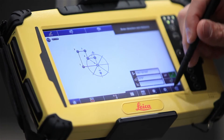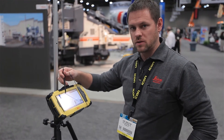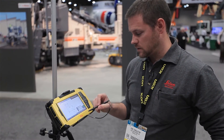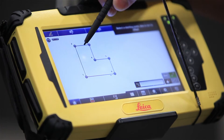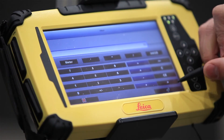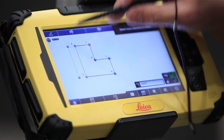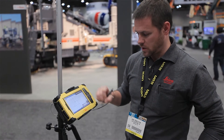So from this point I've got my foundation in, and I know in the field the surveyor has given me two points to start from. Those two points are an offset from this building line to the left at maybe 10 feet. So I can switch my function to offsets, select this line, and tell it that it's 10 feet. It went 10 feet to the inside — that's okay, I have a mirror button. I can flip it to the outside, and since we're only interested in the points I'll turn the line function off and green check mark those into the system.